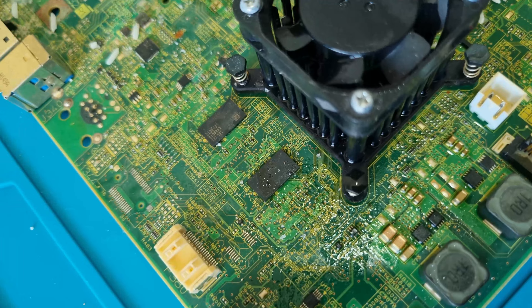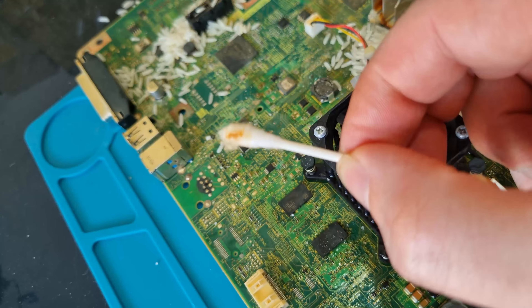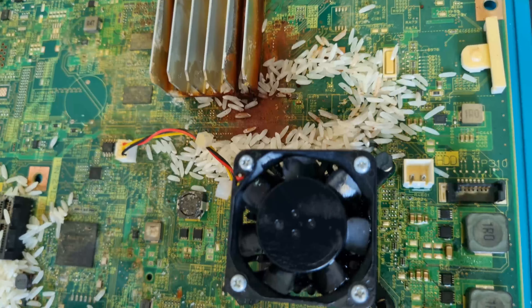I haven't done much down here in regards to our oil spill. It's helped dry the oil up a little bit, but it did go a bit fluffy. This is all trying to clean it by hand. Obviously if you've got an ultrasonic cleaner, you can dump the whole board in there with deionized or demineralized water and give that a clean — a bit better than trying to do it like this. In regards to the whole rice thing, people say it's still wet because the rice will absorb the water. If it's already water damaged, rice doesn't do shit all. Even if it's still wet, rice doesn't do shit all. Look at that — that's not fixing anything. Don't do it.